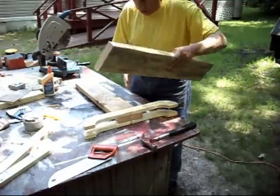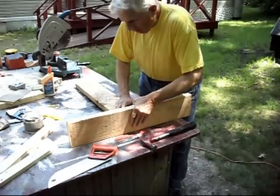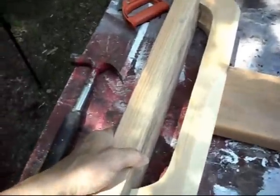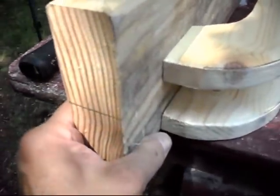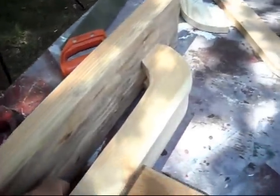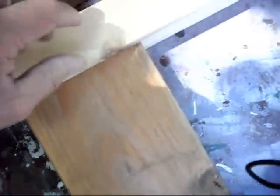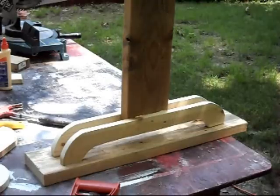And what we're going to do is take a piece of stock like this. See all four feet touching. Show you a little better over here. See, what we do is take a piece of stock, in this case the other leg, and make sure that they all are touching. And as you can see over here, the lines I got here, see how those lines got to line up. Okay, and when it lines up, and it's right up against there and up there, and the bottom is in, we nail it and we're good to go. As you can see, we're sitting flush on all fours.